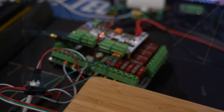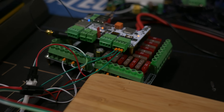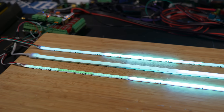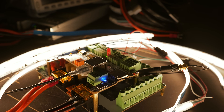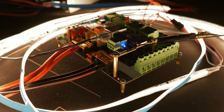First off, if you haven't seen my previous video about higher voltage LED strip, I recommend you go watch that before or after this video since it will explain a few things. Everything in this video is running off of a QuinLED Dig Octa connected to a Mean Well UHP-500-24 power supply, providing lots of clean and stable 24 volt power. The Dig Octa is an ESP32-based controller with up to eight ports with advanced features such as an external antenna or built-in ethernet connection, and combined with a power board makes for a complete solution able to drive 5 volt up to 24 volt addressable LED strips, coming pre-flashed with WLED out of the box.